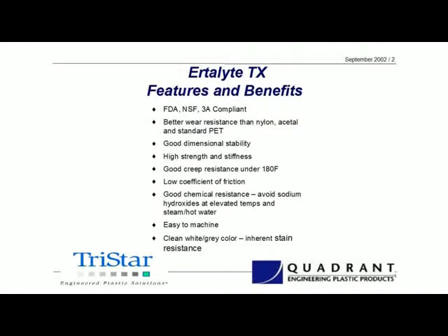It has inherently high strength compared to a lot of other engineering plastics. So you can design for both structural and bearing applications and get good deformation resistance and good impact strength. This material actually has one of the better abrasion resistance properties of any of the engineering plastics — in fact, it's not too far off the UHMW family. It's an interesting material for applications in the food industry where you have a lot of abrasive components.